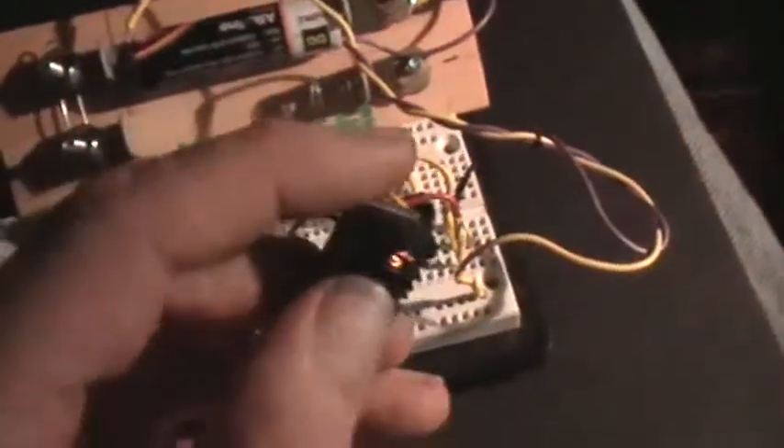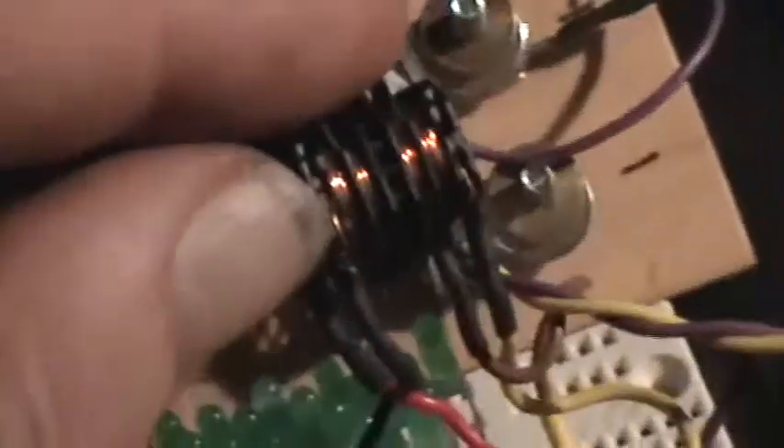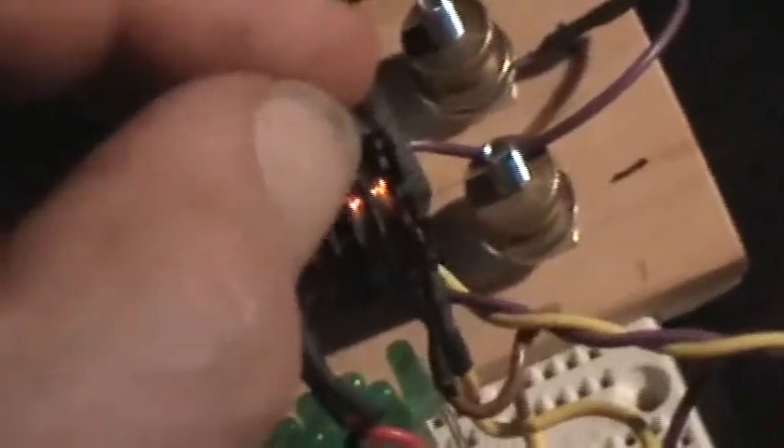The coil I'm using now is one of these — a little inductor that comes out of an old television set. The interesting thing about them is that it's a one-to-one ratio winding, and there are actually two windings: one on the left comprising those two and one on the right comprising those two. They're wound in opposite directions — anti-parallel windings — and it's on a little square ferrite.